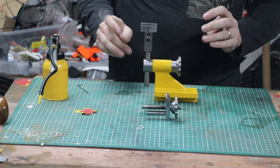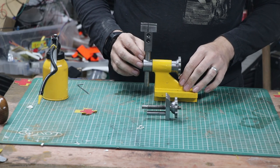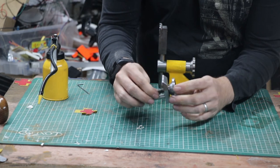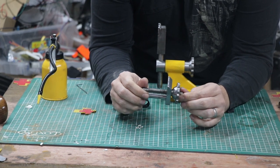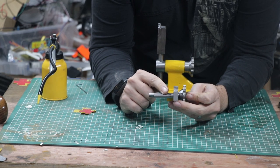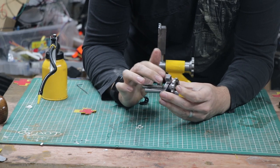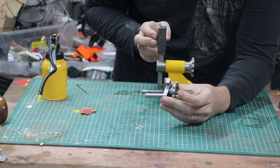It's not the strongest grip in the world - you can certainly overcome it - but this is really intended for light duty work. So then we get to this concoction, which is definitely where the rubber meets the road in this whole thing. This screw thread and this rod need to be extremely parallel to each other in order not to bind up. So these holes have to be exactly the same displacement as these.